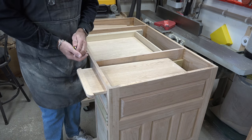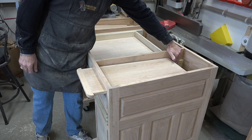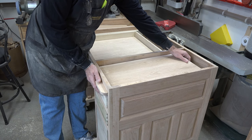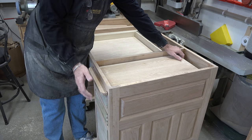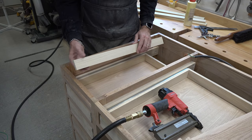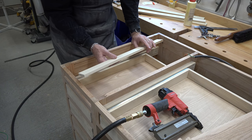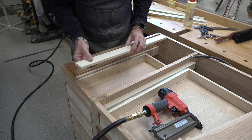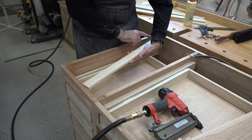In this particular case it's half an inch. We've got plenty of half-inch poplar left over from our drawer glide supports, so I'm going to fur this out from front to back half an inch, glue it in place, and use some brad nails in this three-quarter oak to solidify it. There's absolutely nothing in the plans as far as how to construct these supports for your writing boards, so I've taken this half-inch poplar and planed it down — taken about a sixty-fourth off of it just to give it some wiggle room.